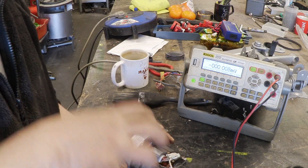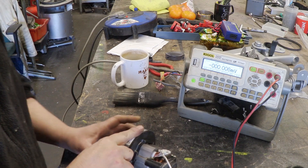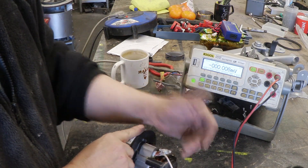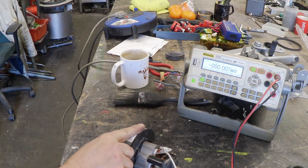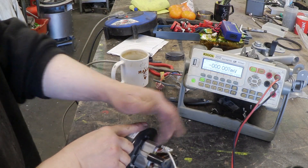I've cleaned it up on the outside — it's still pretty dusty on the inside — but I've connected up my multimeter and you're going to read a voltage off of it. Now, it's a DC generator, so if we spin that, we should get a DC voltage out of it. To do that, I'm going to put a vacuum cleaner hose right on there, and that should spin it.